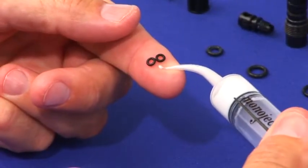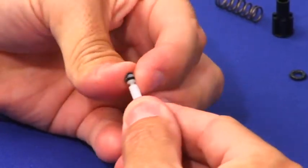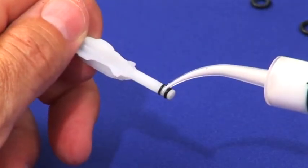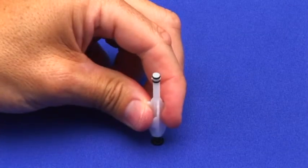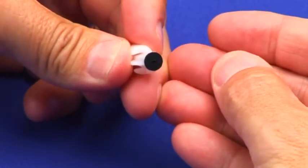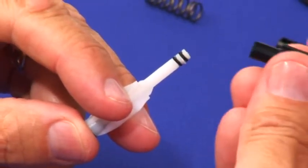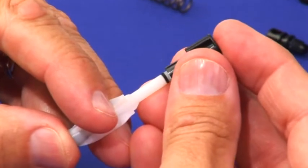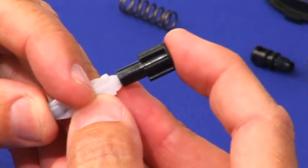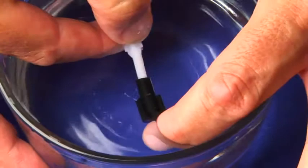Lubricate and refresh the new poppet O-rings and low pressure seats supplied in the maintenance kit. Push the lubricated O-rings into the grooves. Pull the second O-ring onto the stem and use your nail to pull past the first and into the inside groove. Apply a bead of quality lubricant between the O-rings. Using a clean, hard, flat surface, firmly press the poppet onto the low pressure seat uniformly. Wipe the surface of the newly installed low pressure seat to remove manufacturing residues. Test for air-tight integrity by capturing air — seal the low pressure seat hole with your thumb, place the balance chamber onto the stem just enough to cover the O-rings, then squeeze the components together creating an air spring. The chamber should spring up and down as you push and release. If the components go flat, submerge under water to detect the source of the leak revealed by bubbles.